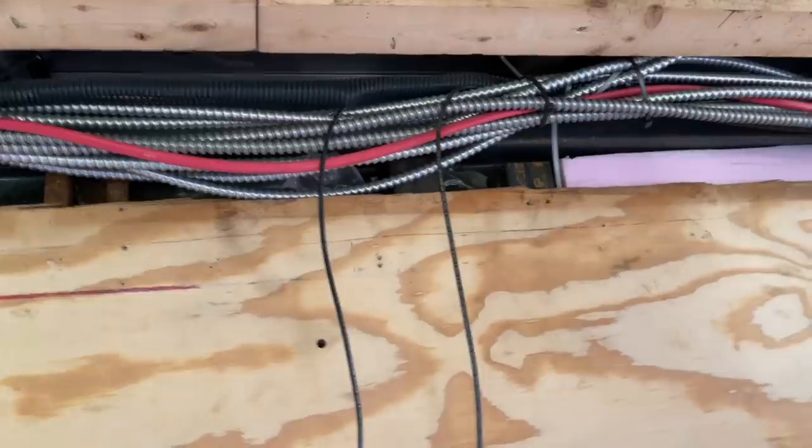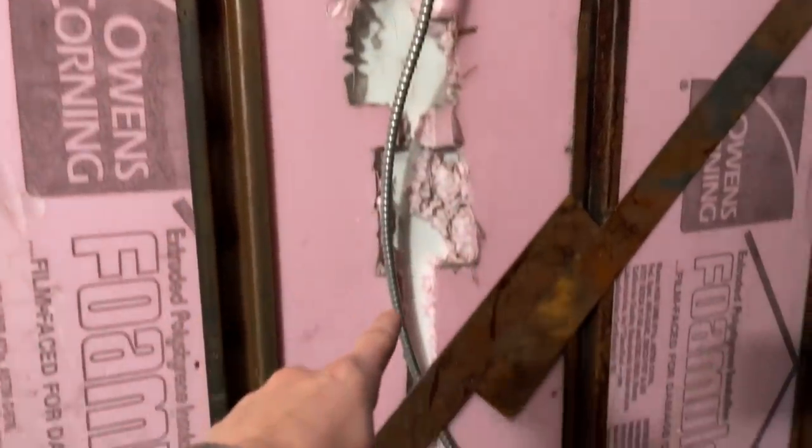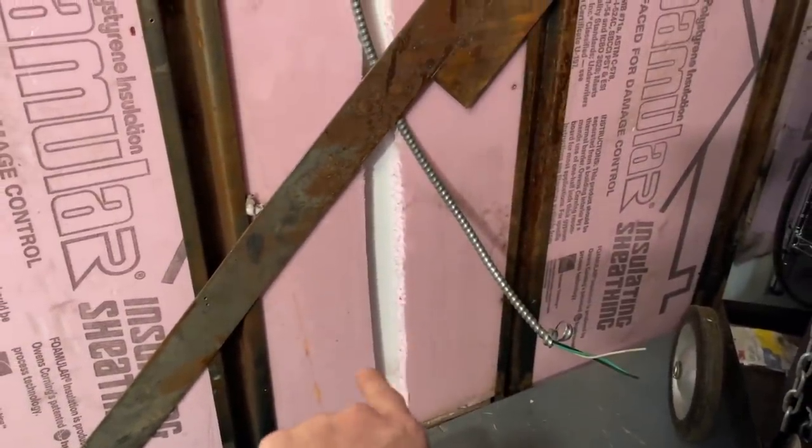Erin is ripping out a bunch of old wiring that we are not going to be using. He's already finished with this side and it looks really nice. So he's now doing that side and it's looking really, really good. Another thing that he has done is move some of the outlets down the wall, so he's had to extend a few wires. When we got that inside paneling in, we realized that we didn't want our outlets really high on the wall. So that's where the outlet used to be and Erin extended the wires down so it can be down at the floor, and he'll do that with all the outlets. Little by little, we're getting there.